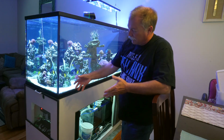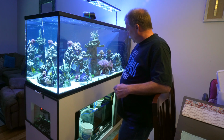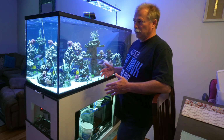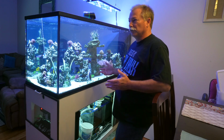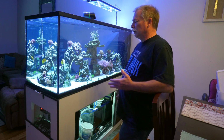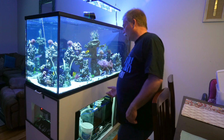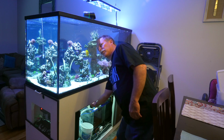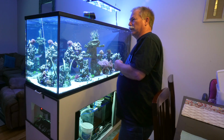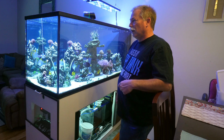So when it came to cooling, I found out that fan was insufficient. I started looking for other ways of cooling the cabinet. I did a lot of experimenting and discovered that really the most effective way was to run a higher volume fan for a short period of time over running a lower volume fan continuously. So it's been my experience that continuous movement of air is not really the way to go. What you really need to do most effectively is to purge the air volume under the cabinet at one time. So I have a thermosensing probe that's attached to the Hydros that sits just under the tank at the top of the cabinet. The way I have it programmed is anytime the cabinet exceeds 80 degrees Fahrenheit, the fan will kick on. Or for 5 minutes every 20 minutes it runs. So it'll do both. All controlled by the Hydros.